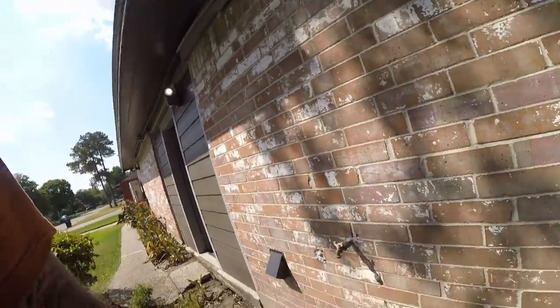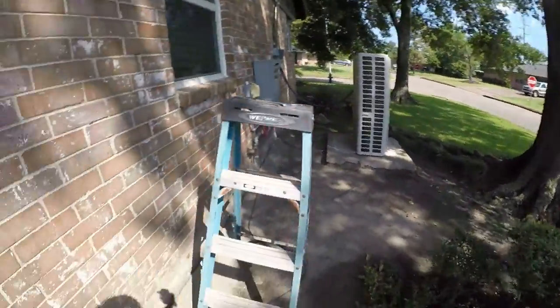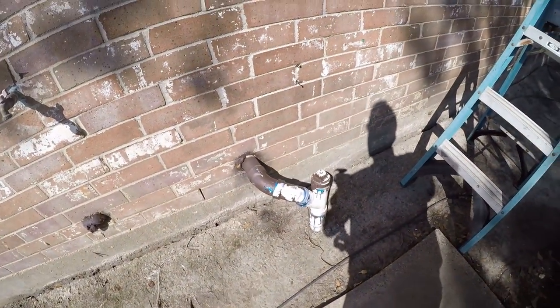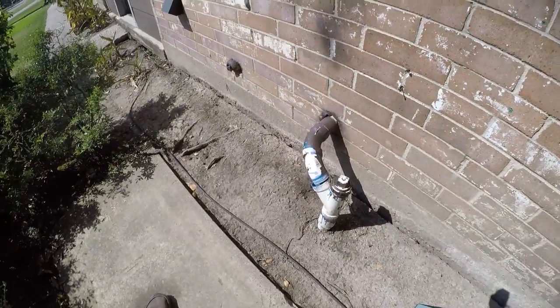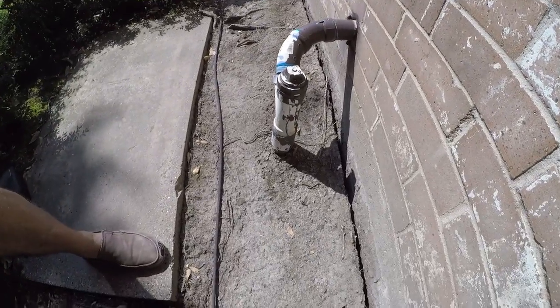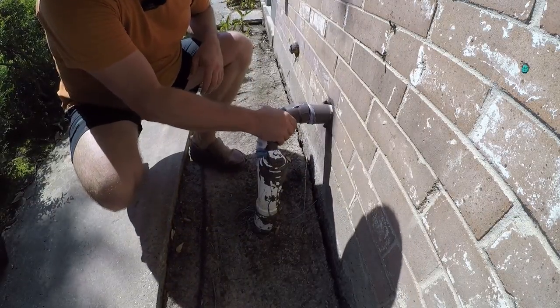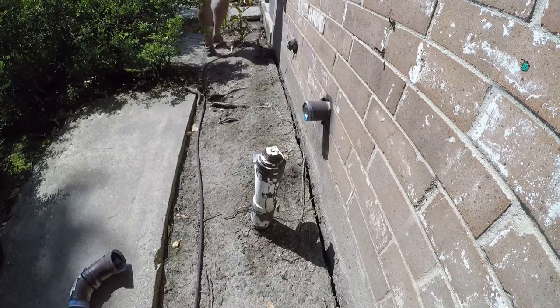Hey friends, it's Brian. I've got a little plumbing project today — a pretty short, quick, simple fix. We have expansive clay soils, and unfortunately this tree, which is really too close to my house, has sucked the moisture out of the dirt and caused it to sink maybe three-quarters of an inch. The house has been underpinned so it's no danger, but it caused my plumbing to pop loose. I'm going to put up a piece of rubber boot to take its place.